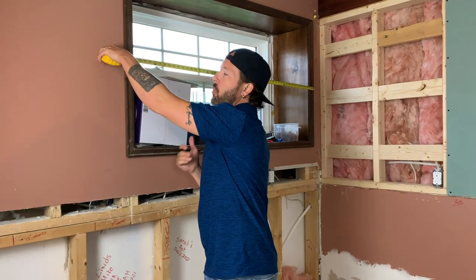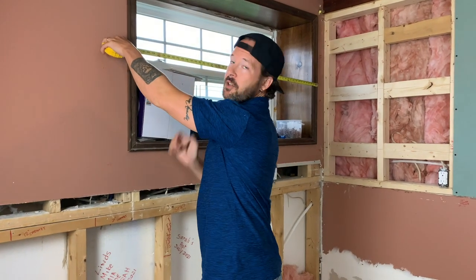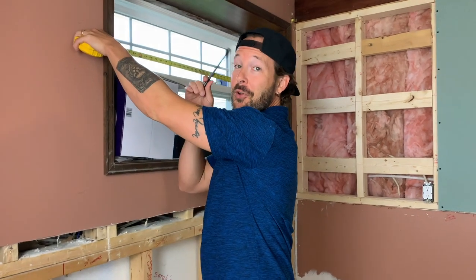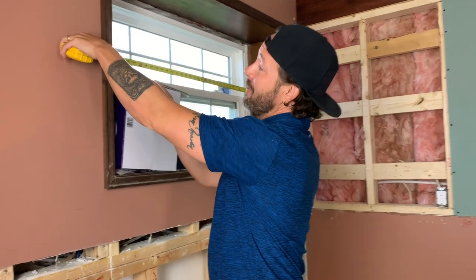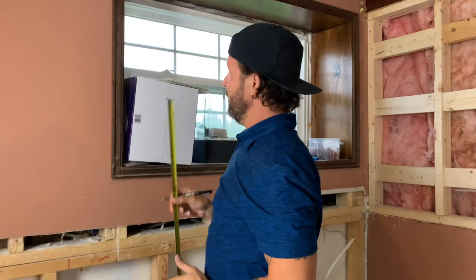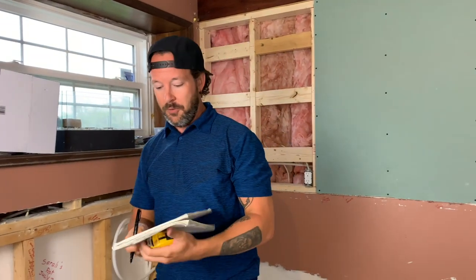It's important to measure everything in inches. Don't switch between feet and inches — keep everything in inches so it's consistent the whole time. When you're measuring and reading your tape measure upside down, make sure that you flip it around in your head so that you don't write down 35 inches instead of 53 inches. It will definitely happen to you if you're reading your tape measure upside down, and hopefully it doesn't cost you thousands of dollars like it has me.